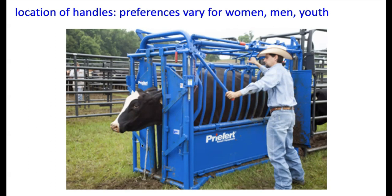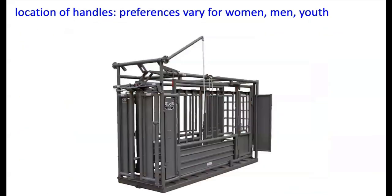But from there, WD-40, and then I like to, after we get done working cattle, wash that squeeze chute out. If you leave that manure sitting in those squeeze chutes all the time, you'll rust those bottoms out a whole lot quicker. And especially the older ones that used to have wood bottoms in there, you'll rot those wood bottoms out real quick. So I'm going to wash it off. If it has something like this that I need to treat before I use it, I'll do that. And then it kind of comes down to touch-up paint. If we wear some paint off of it, see if you can get some paint from the manufacturer and just keep that touched up, just to keep that rust down. If you're talking about the saloon door style that has this cable set up on the head catch, maintenance is you've got to check and make sure those nuts don't come loose and that it's working well. Otherwise, maintenance is going to be pretty similar across all the chutes.